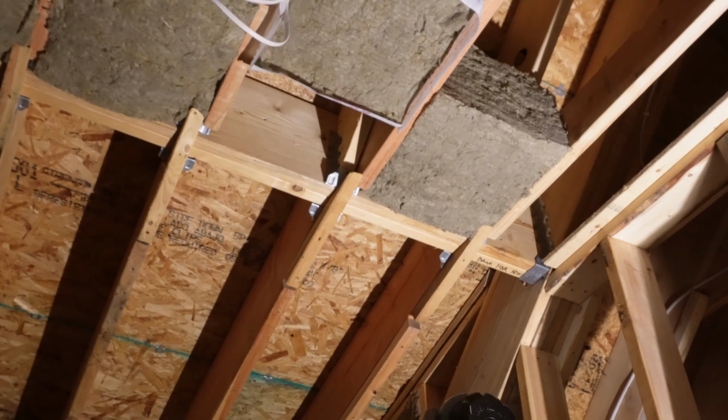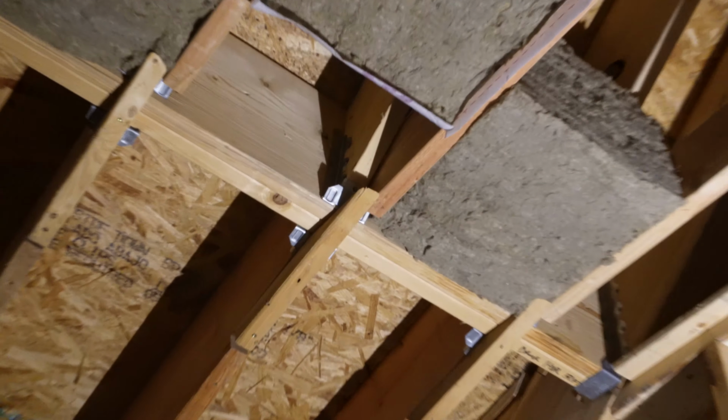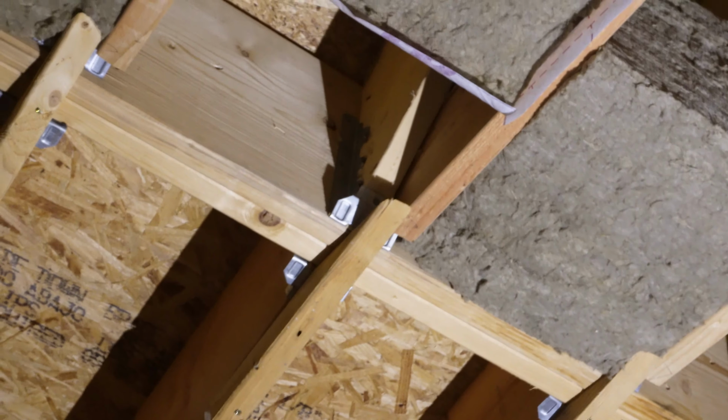As we're finishing out this back ceiling, here are some of the fun situations we're running into. Cutting insulation to fit around all these ceiling joists and rafters. This is a fun one. That's a 4-ply beam over there in the dark that we got to squeeze something in there. This is the fun shape that I cut for that guy. The total width is larger than a normal 14.5-inch stud bay, so these have to get cut long ways to 16.5 inches. Take out that 2x6 ceiling joist, and then on the other side here is where I took out for the 4-ply beam. That's 6 inches at a 10-12 pitch.